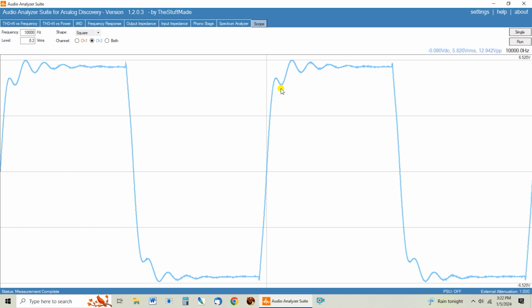Yeah, need to do a little tuning here. I think a small bit of capacitance, might only take like 10 pF, will tamp down this oscillation and make this just kind of roll like that. So probably going to do that, because the next thing I'm going to do is go ahead and put the transformer on the other channel.